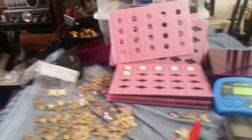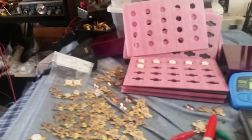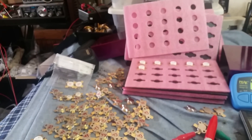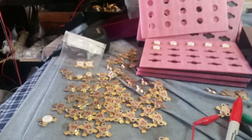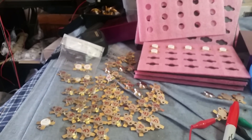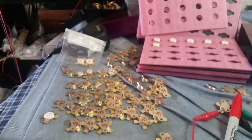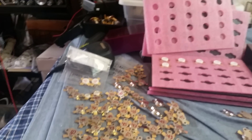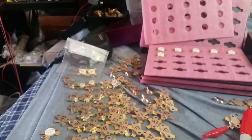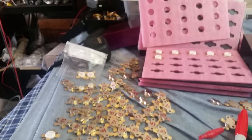And that thing puts out just as much power as it did when new — no problem getting up to 1,200–1,300 watts RMS. The golden rule here is you want that number to be the same. You want to match them by this number. Look at it as a characteristic number — when you're putting transistors in sets of four, eight, or sixteen, you want them all to have the same characteristics.